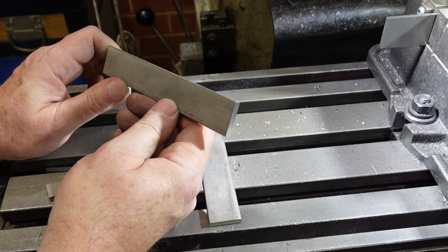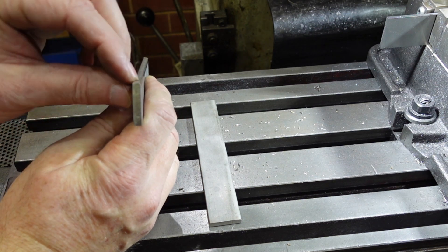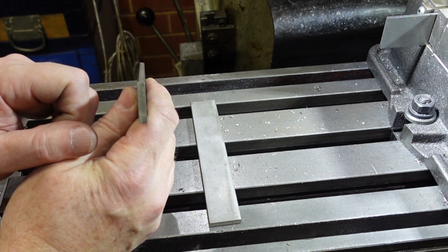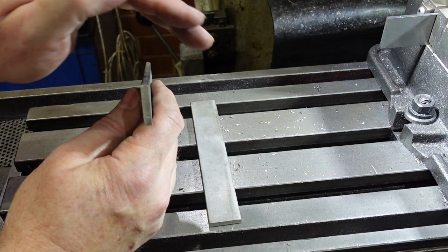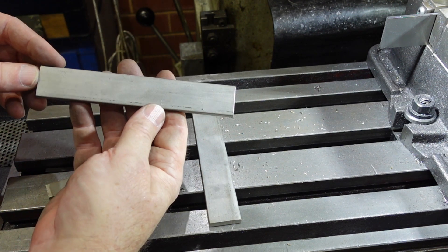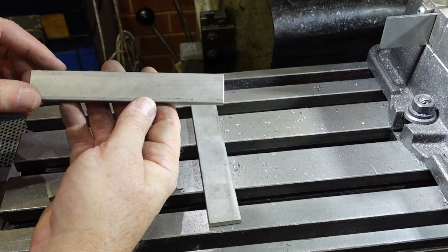My starting point here is some 25 by 5 stainless strip. I could have gone for some 20 but I want a nice sharp edge. You can probably just see on the edge of the stainless here it's not sharp — it's got some rounded bits on it. You've got to watch that with sheet because sometimes it's rolled and you get a rounded edge, sometimes it's sheared and you get a distorted edge. So unfortunately I'm going to have to take a little bit off each side, but what I'm going to end up with is two strips 151 by 20, and then I'll start putting some detail in.